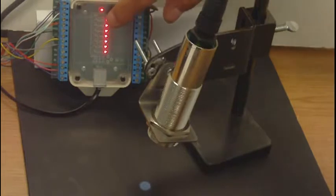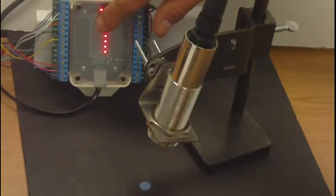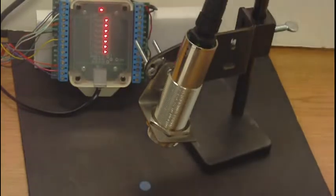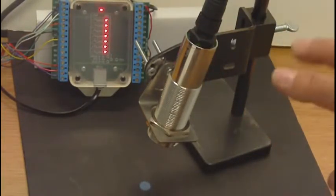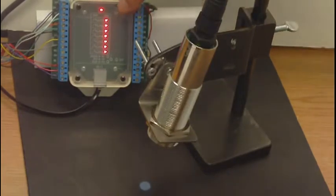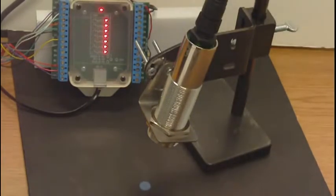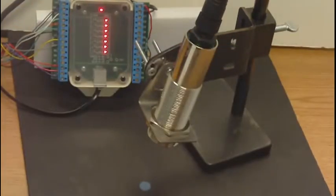The LEDs use the first four LEDs as indicators. When the four LEDs are on the right-hand side, the outputs are low. When they move over to the left, that indicates a high output. The outputs for the channels are binary-coded in hexadecimal format. So, for example, when there's no match, they're all low — all zeros. When channel 15 is a match, then all four LEDs would move over to the left side to show an F.